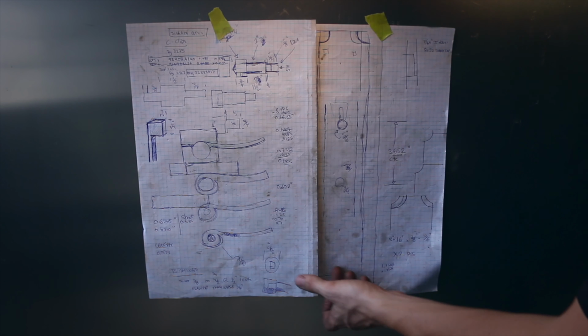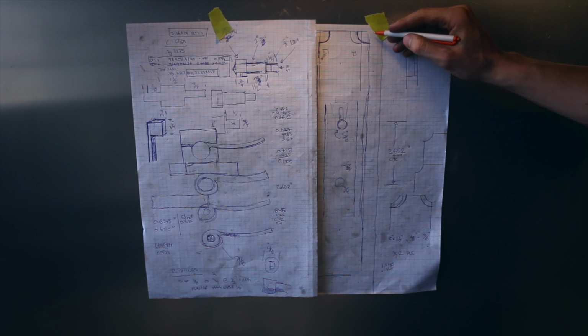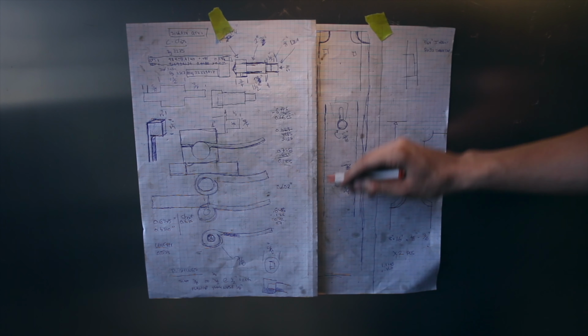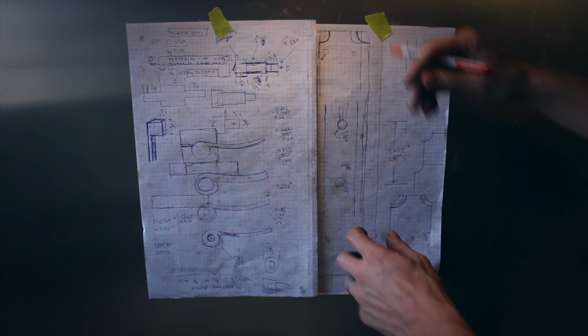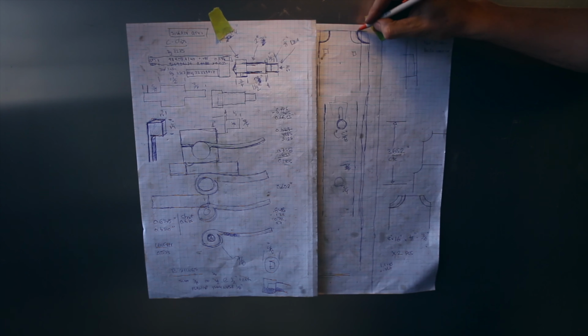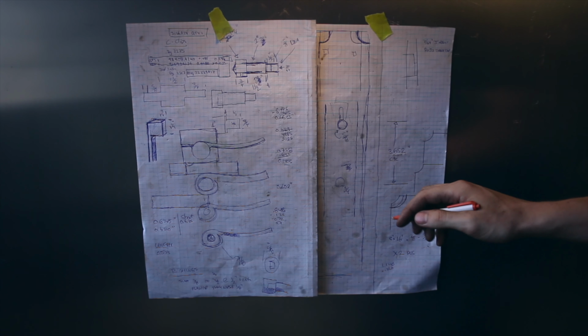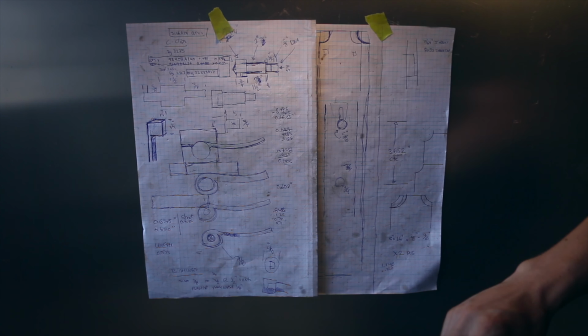I quickly put this on here so you can see the chicken scratch plan. So hopefully you can make this out. This is going to be the rectangle piece of steel here that all the door handle will sit on, and the deadbolt. I'm going to cut in these corners, hoping to do that hot with a curved chisel. So that'd be on each corner. And then the handle's going to sit here, the deadbolt here.